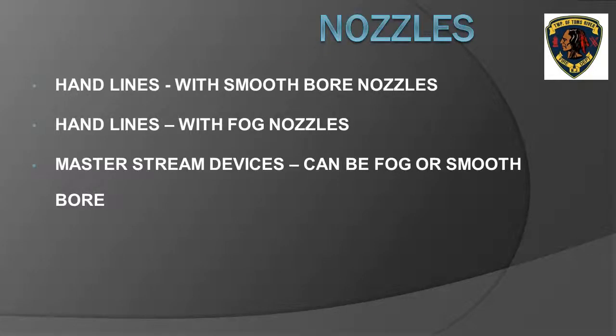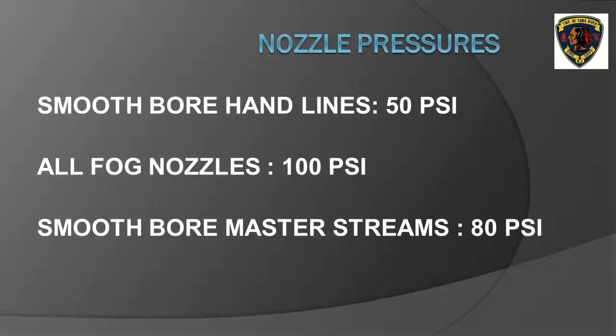As a general rule, the fire service uses three types of nozzles: smoothbore nozzles and fog nozzles that are attached on hand lines, usually inch-and-three-quarter or two-and-a-half inch. The third type of nozzle is a master stream device. These nozzles come in the form of deck guns, ladder pipes, or blitz fire style ground monitors. All nozzles require a certain nozzle pressure to operate properly. The nozzle pressure is developed by using the fire apparatus fire pump to increase the pressure in the hose line to overcome friction loss, and the net pressure results in the nozzle pressure.